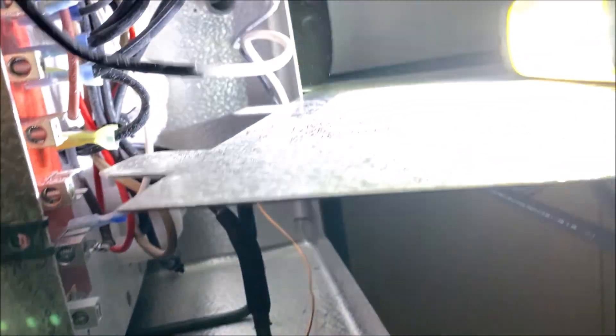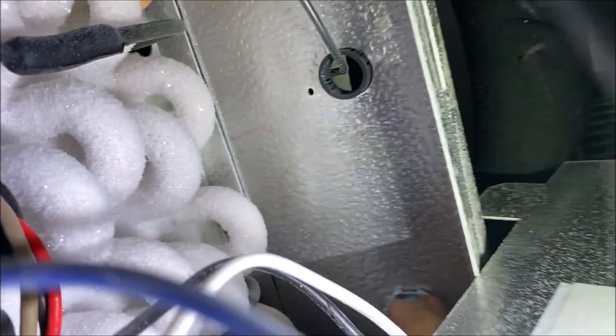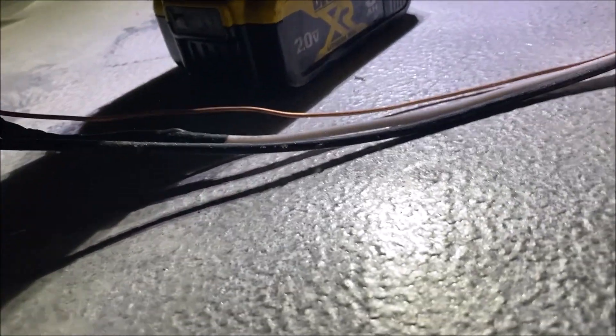As you can see I've removed my incoming power here. As we determined before, it's going to be 4 and N. You can see here I have my two-wire conduit, and all I'm going to do is remove it — pull it back out through this liquid tight — and we're going to go upstairs. Here's my two-wire conduit; let's pull it right through and we're going to run a fresh four-wire conduit and wire it as per the schematic.